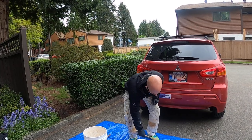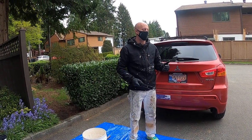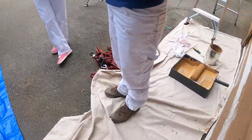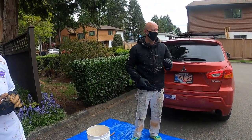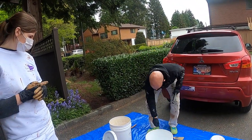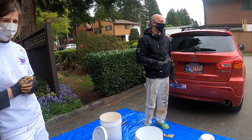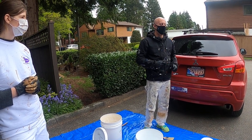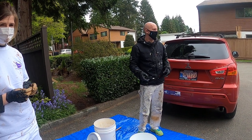With rollers — if you want to clean them out — for a color like this one, I would wrap the roller at the end of the day. When the job is completed and I'm done with it, I use my 6-in-1 to scoop out all the paint and throw away the roller. That's not one I'll be able to clean out that well, and since they cost about three dollars, the amount of time spent probably isn't worth it.